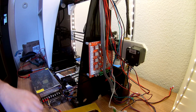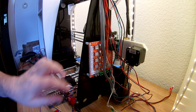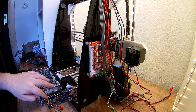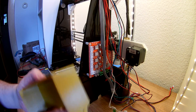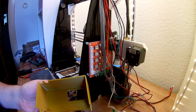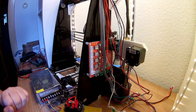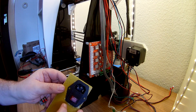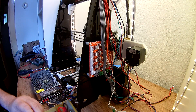So you can turn the power on and off. This is the ground — there you must plug the grounding cable. And here to these two connections add the power cables. Then we have to connect to these three connections the two MOSFETs and the motherboard. All the cables must fit in here. I'll fix the switch now with hot glue, and then it goes on to put everything together.